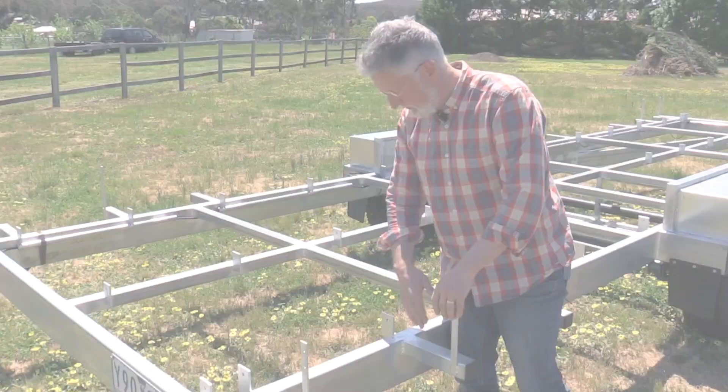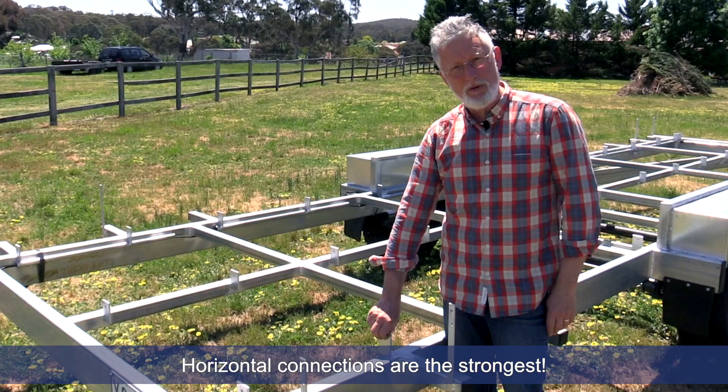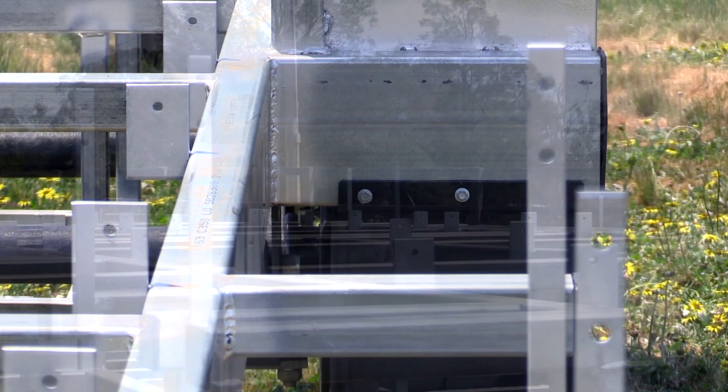First thing is a bit of plywood goes down here. The floor joist goes all the way across here and then this is where your wall is. This bolts in horizontally, which is the strongest and safest way to connect the tiny house and the trailer — to have a horizontal connection system. And then this is the wall. We know where your wall is going to be. We put something to grab hold of it nice and strong.